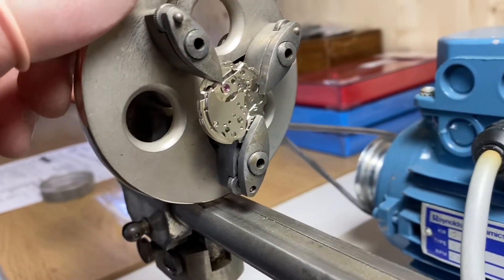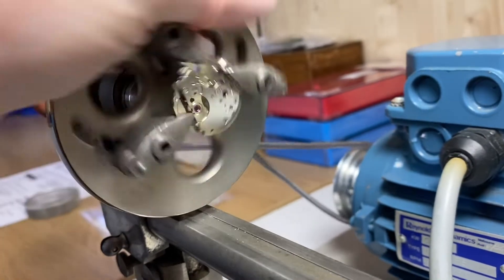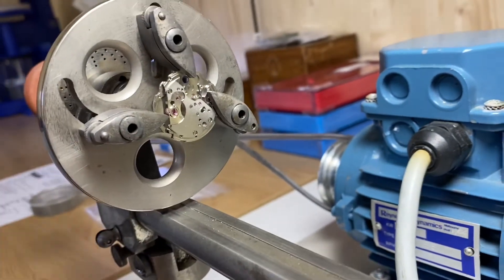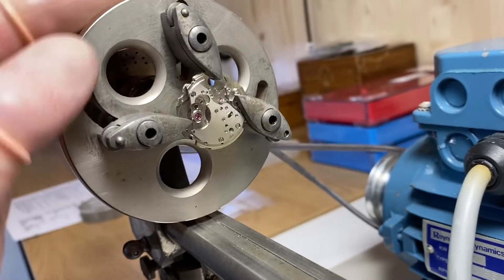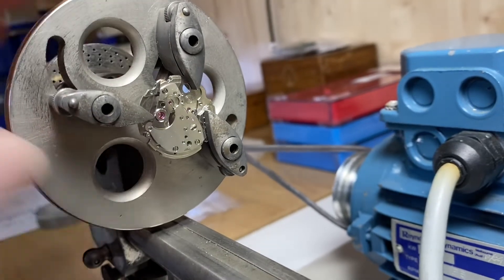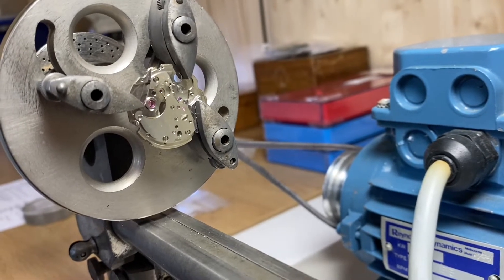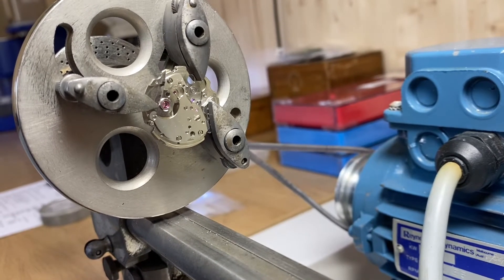Before we start drilling or measuring, the first thing we need to do is fit our jewel for the barrel into the bridge first, because remember there's no drilling required here. We just press out the old brass bushing and then fit the jewel in the barrel. A lot of you will probably be trying to rejewel your barrels — perhaps buying them from Adrian of Vintage Time Australia. He does some great stuff getting these jewels manufactured.